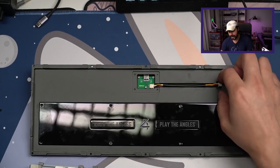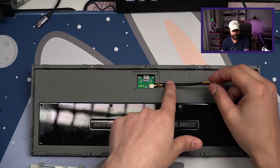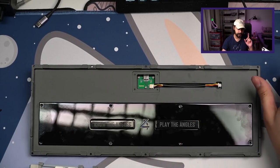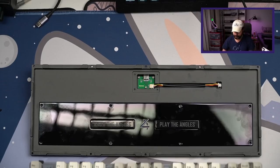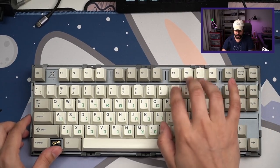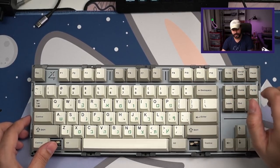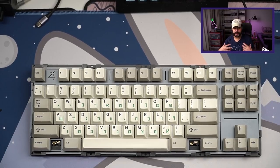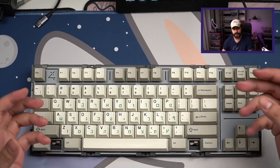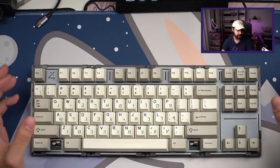So Vertex said that this cable channel would also be widened. There's a couple ways to do it. Either you can widen the cable channel, or you can essentially get a thinner JST without this sleeving, and both kind of have the same effect. Obviously, if you widen the cable channel too much, those of you that are paying attention, then it leads to issues with acoustics, because now this area right here, starting at the zero and ending with the backspace, is pretty much directly under the cable channel. So these will already sound different than the rest of the keys, just from that small little cable channel. But if I were to widen said cable channel, then it would have an even more pronounced sound difference, because essentially you've got more room for a reverberation to echo in there and come back at you. And the more open a space is, the more it'll reverberate, the more it will echo. So Vertex has to play it just right.